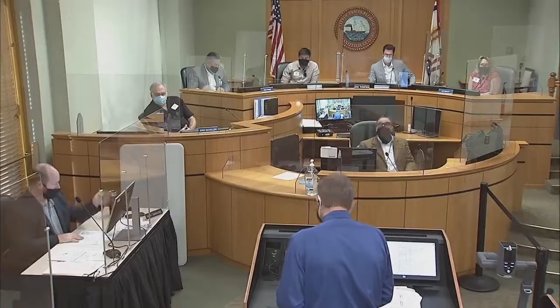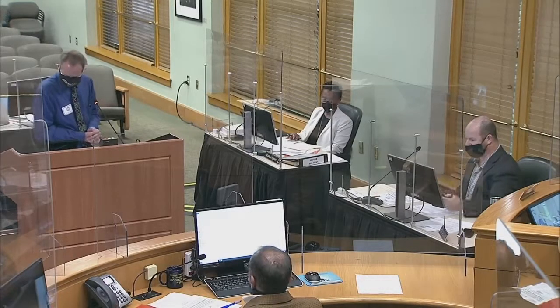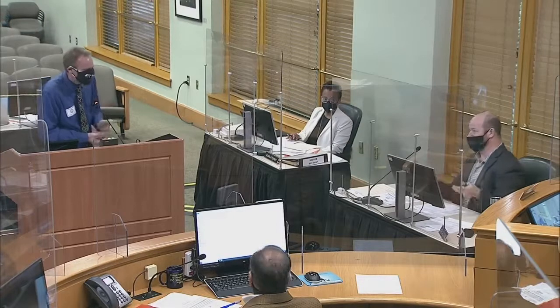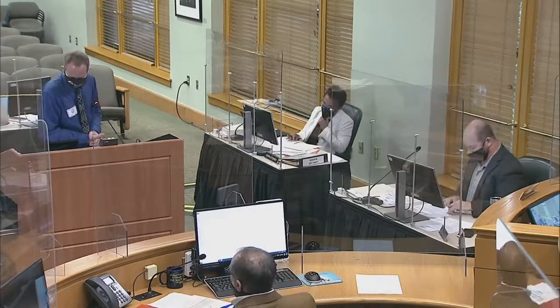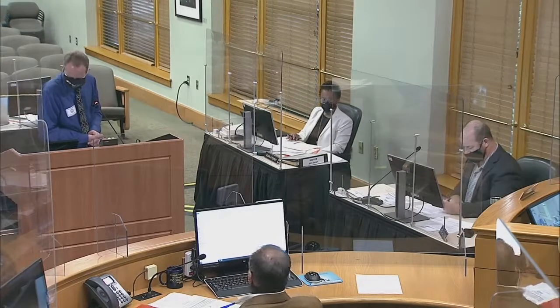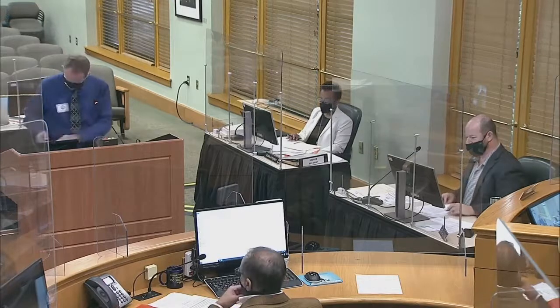I think you have a gable roof. This shows a hip. I mean, that's pretty minor, but you may want to clean that up just to get coordinated. I think that's some of the issues that we faced last time, coordination between the floor plans and the site plan. No big deal on that. My only concern, if you could bring up the side elevations.